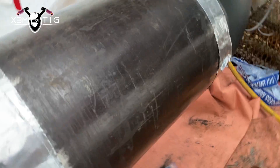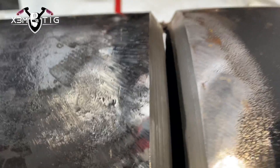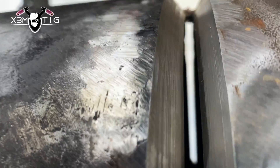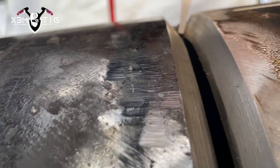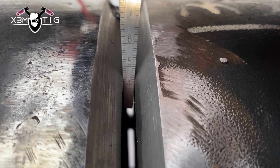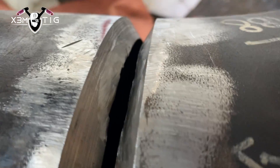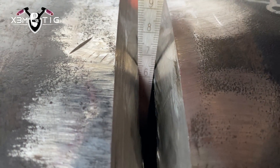This is prep from the previous shift. They did prep the machine, they cut it out and put that piece in. As you can see, it was machined — they didn't use any grinder to smooth it out. That bevel still has those machining marks, but we're gonna leave it as is. As long as it's clean — they cleaned it inside as well, a couple inches from that edge. The tacks are really beautiful. It appears they did a root tack then cut it out, so we got some uneven edge here on the bevel.